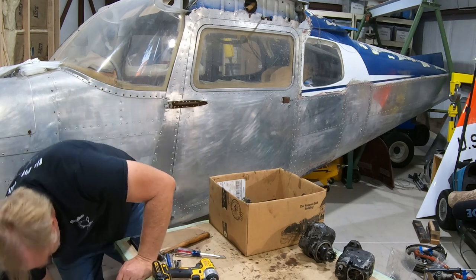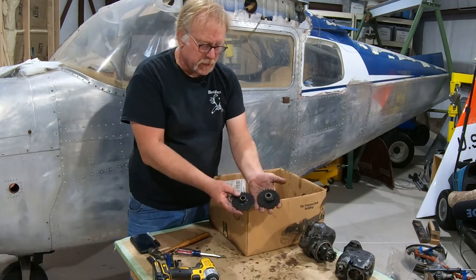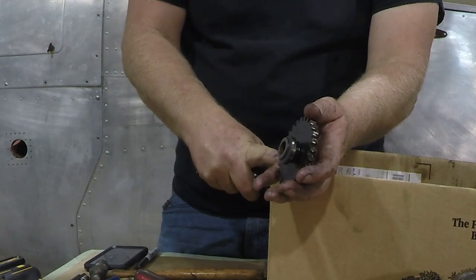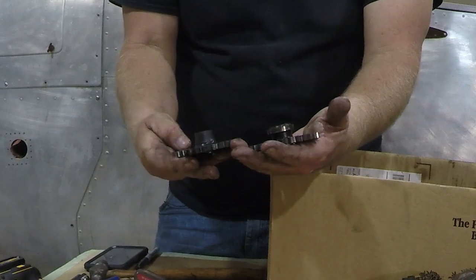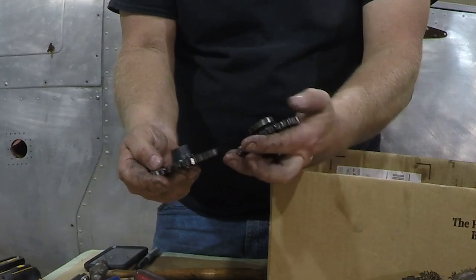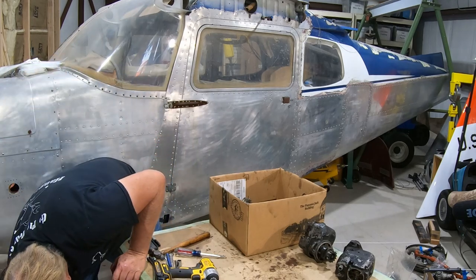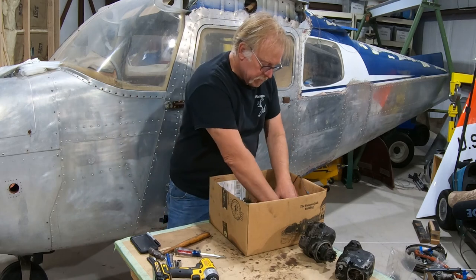Oh, one of the gears, I'll show you, these are basically magneto drive idler gears. One of the gears has an eccentric on it, and that's for pushing your push rod for your fuel pump. So you can see the difference on them. They've got match marks on them, timing marks, and I'll show you that. They've got a zero etched here, and then the cam will also have markings on it. So those are there, ready to go for magnetic particle inspection and whatnot.